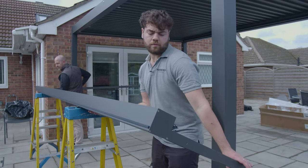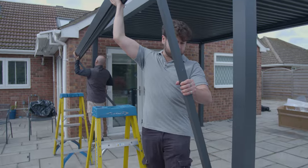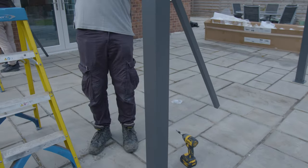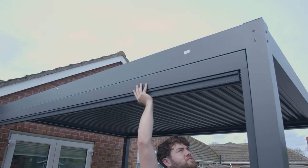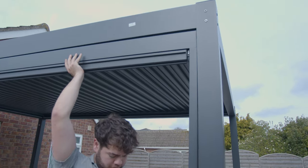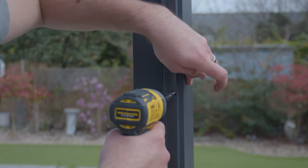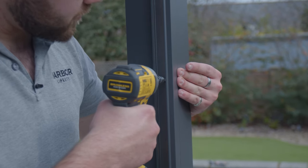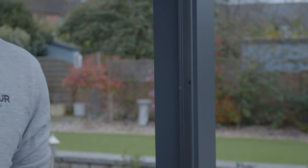Once those legs are on, with a person on each end, lift it up into place, bringing the legs inside of the legs of the pergola. Up the top here just make sure that it all lines up and fit the blind into place, making sure it's flush with the outer edge of the pergola here. Once we've got it in place, there are these four holes up the length of the leg — all we're going to do is take one of our self-tapping screws and, making sure that the outer edge of this leg is flush with the pergola, just screw these into the leg of the pergola so that it's all fixed in place. Same on the other side.